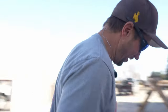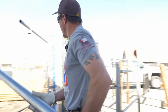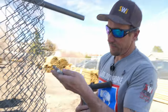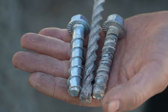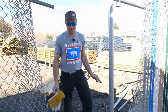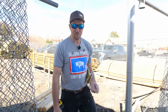So that's the one that we took out and this is the one that we're going to put in. It's a lot bigger — it's still a 40-weight post, but with a gate you want to go with a bigger post. The flighting on this bit matches the thread pattern on this concrete anchor. These concrete anchors are so cool because if you take something out like we just did, you're just left with the hole. You don't have to worry about a stud being there or driving the stud into the concrete and filling it back. You can just pull this out and patch it right back. It's super easy to deal with.